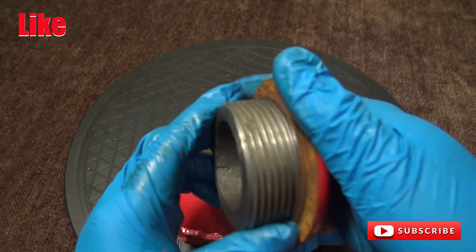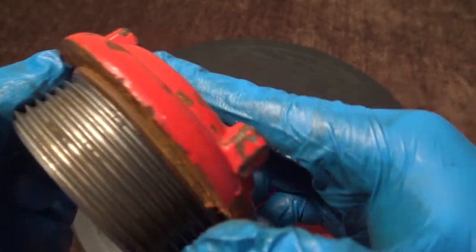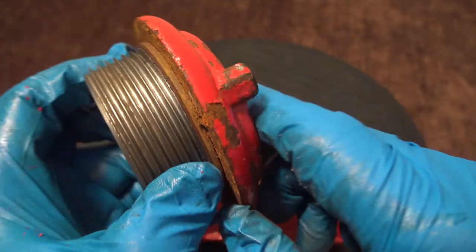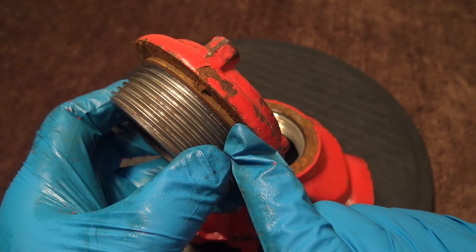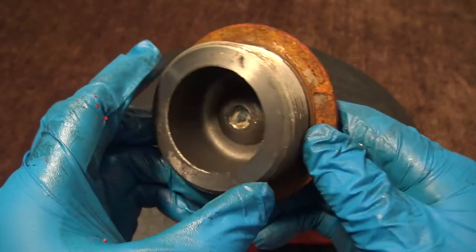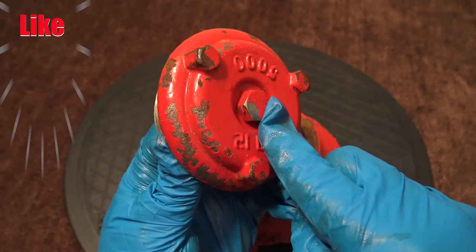Here's a closer look at the bonnet. As you can see, it has an o-ring at the top that creates the seal. This is made out of a viton material. Then you have the threads, and here you have a port right inside with a plug that you can remove to add any instrumentation.